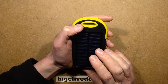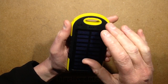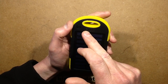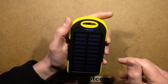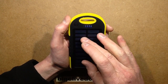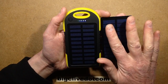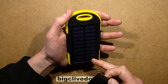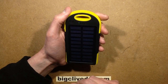This one is different though - it doesn't even look like the picture on its listing. Whereas the other one had 4 LED positions, and the solar energy LED that lights with the output from the solar panel was just sharing one of those positions, this one has its own indicator position for the green LED connected to the solar panel, and it's got 4 positions for the other usual charge indicators showing state of charge. Another slightly disappointing feature is that compared to the last one I took apart, which had quite large sections of the silicon solar cell, this one has much noticeably smaller sections. It's no great deal, particularly in the UK - we don't get much sunshine anyway - but it's just a wee bit cheap.